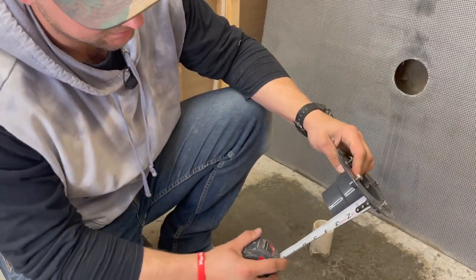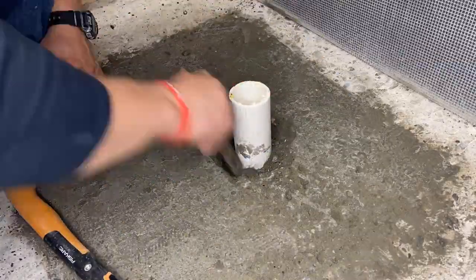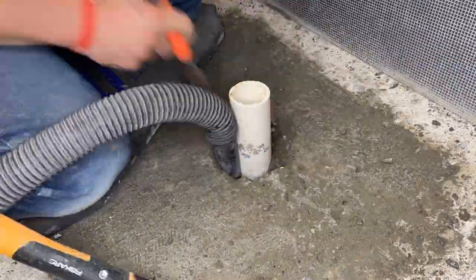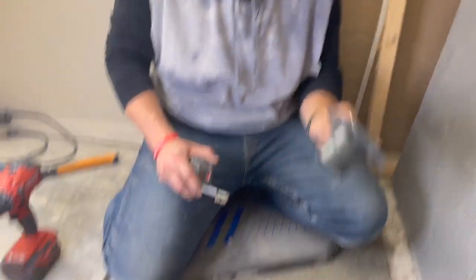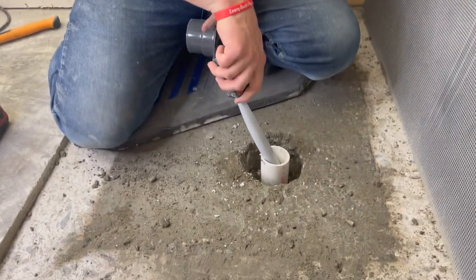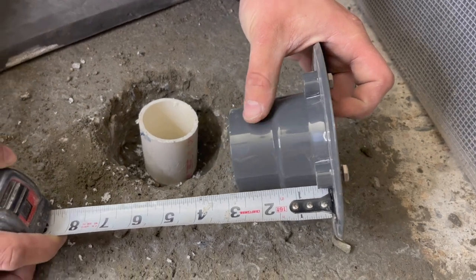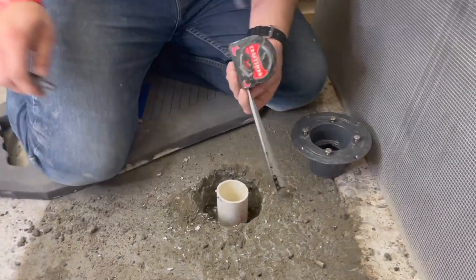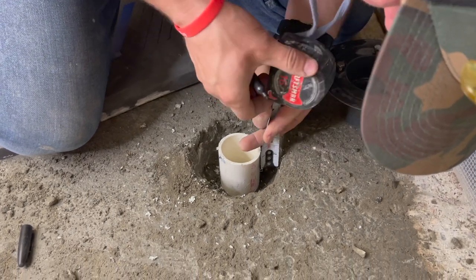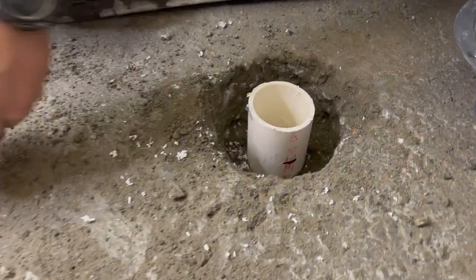In order to do that, this has to get glued in right here. We need to measure the depth first — let's say three inches. I'm going to dig a little channel right around the pipe. In retrospect, I probably should have set this yesterday and made sure it was nice and even, but I was in a rush. Now we have to cut this down to fit. We want to cut about inch and three quarters off, so I'll mark right there.